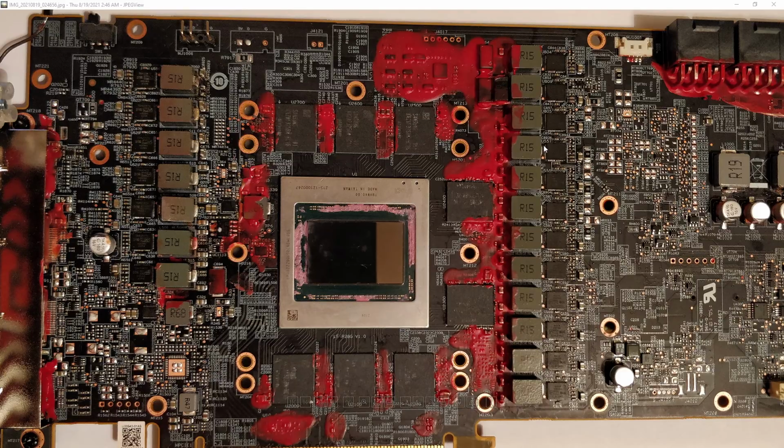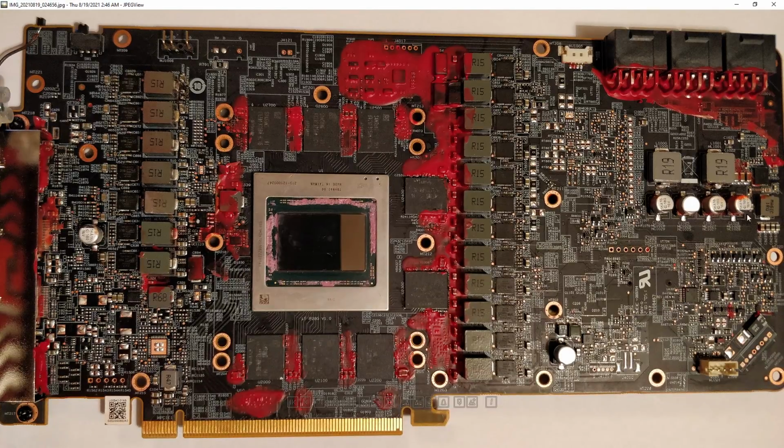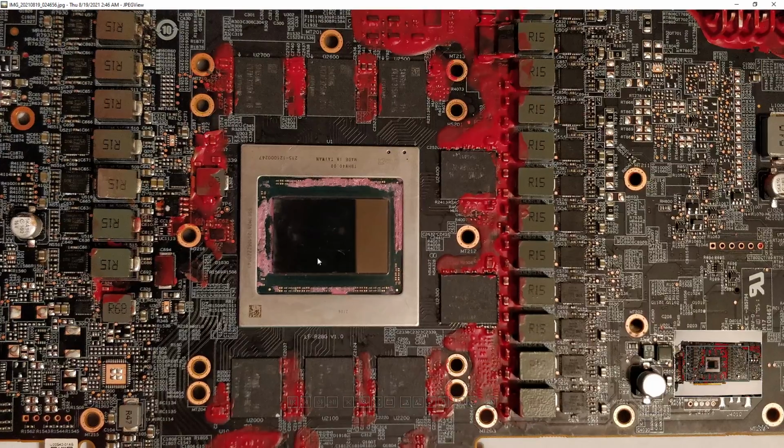And so the thing is, basically all of the bulk capacitors, so all the 12 volt bulk capacitors on the GPU, on your motherboard, in the power supply, those are still connected. When the power supply turns off, all of the energy still stored in all of the 12 volt capacitors everywhere, that's still there. And with that shorted high side MOSFET, it's all making its way as quickly as possible through the GPU core and to ground, which, that's where you get the crack from.